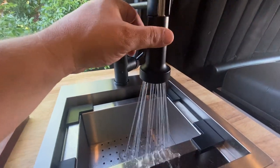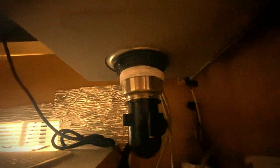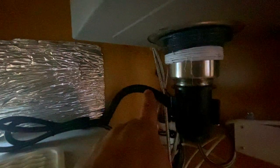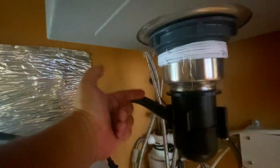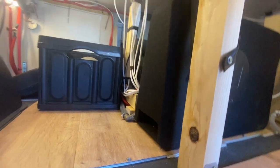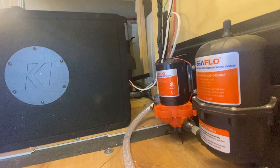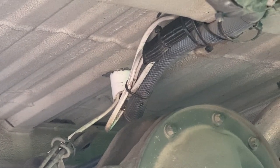This is the filtered water at full blast — great water pressure — and the same for the shower. Now let me show you how the water exits the sink. Underneath the sink we have one of these Camco RV sink drains, which just twist on. If you're worried about any odors, make this loop a little higher so there's always a little water sitting there and no odor can come back. We are underneath the bed area: the shower water goes into that 90 right there, and in front of the subwoofer there's a hole going down underneath the van where the sink water comes out. They both meet up right where the 'K' for Kicker is on the ground and drain out from underneath the van.